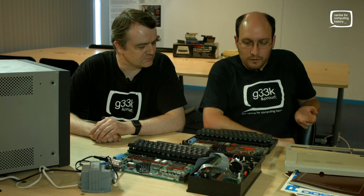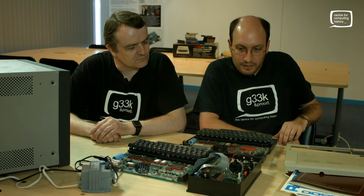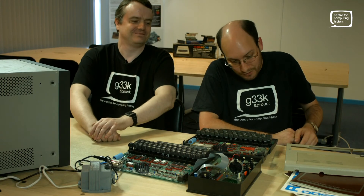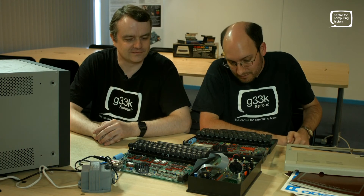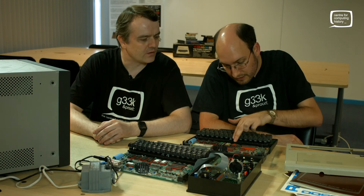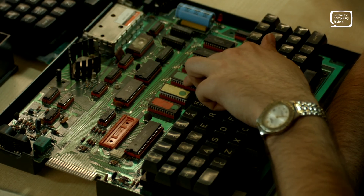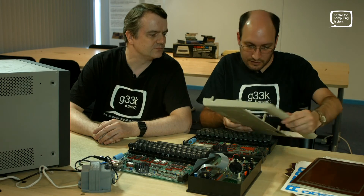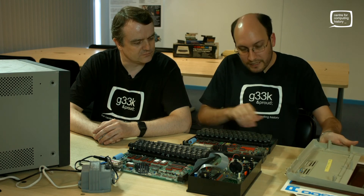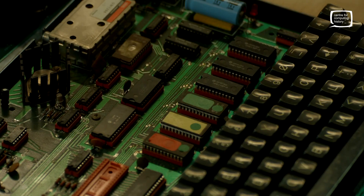There was a second type of peripheral board that didn't have the fan and the heater - basically a digital interface with a couple of switches and LEDs. There was also a plotter board for controlling a plotter, and you could design your own at some point. These aren't proper mask ROMs - they don't have proper type labels. The reason for that can be found on the inside of the case: there's a note that says V8E prototype firmware. So at some point we'll have to dump these ROMs and compare them to all the others to see what's changed. As far as I know it works in exactly the same way, but without lowercase support.